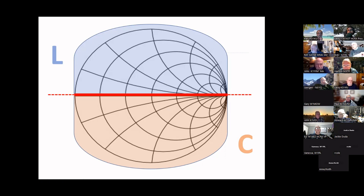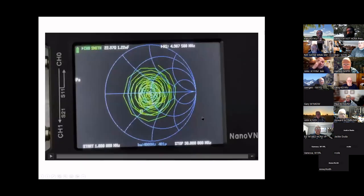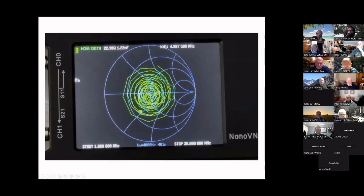You can use the NanoVNA Smith chart to tune your antenna — stick the NanoVNA in place of your transceiver and bring your antenna right to it. First, short the static off your antenna — don't make that mistake. This next video is about eight and a half minutes and shows using the NanoVNA with a 200-watt antenna tuner. Just remember: if I say 'impedance' I mean 'inductance' in this video — I need another cup of coffee.